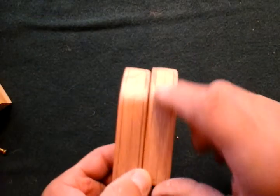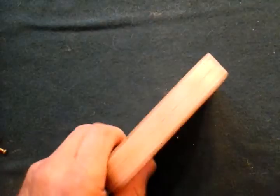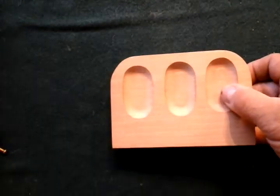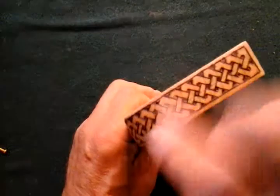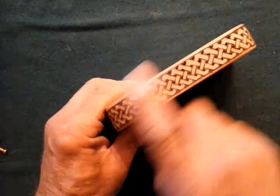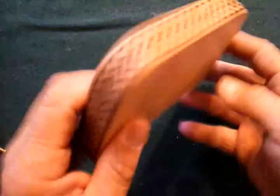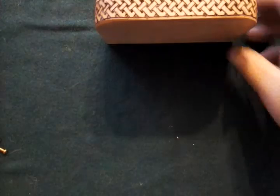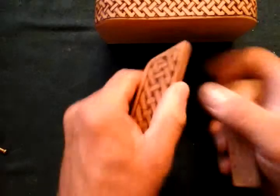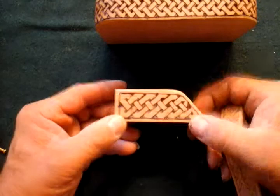I don't really do the bottoms right now. As soon as you get your edge piece done for your bowl rest, go ahead and burn it in. After I burn it in, I take steel wool and steel wool off all the ink or the lead from the pencil — all your markings. That way I get this set up first. Then I go ahead and burn in just the sides, not the bottom, for the braces.